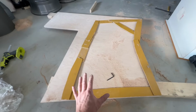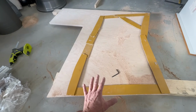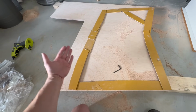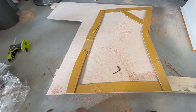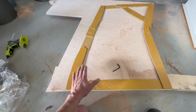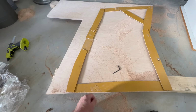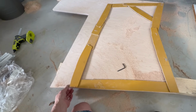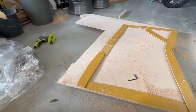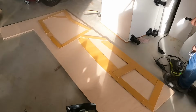The trick when making a floor is to think about the hull. The lower part of the hull has a curvature. And when you measure, you will probably measure the lower part, and that is a challenge because you want to take into consideration that it is going to have an angle towards the hull, so it fits as good as possible.